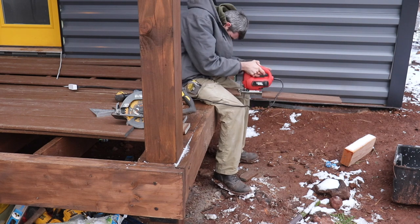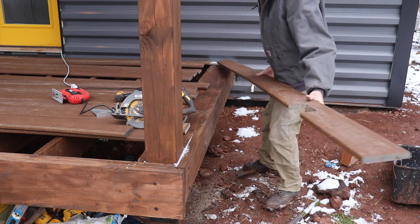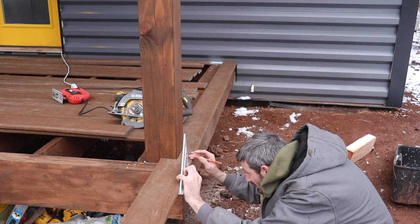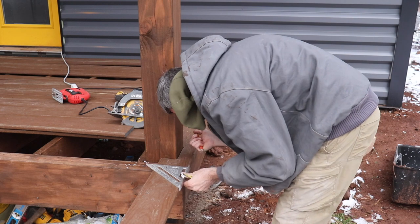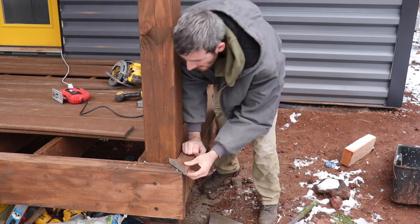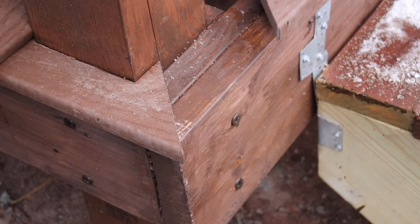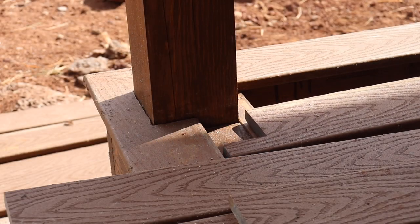And then you might be thinking to yourself, when we were building the structure for the deck, what was that horizontal, that flat 2x6 that we put in there for? We're doing what's called picture framing the deck. Because we're using these composite decking boards and the edges of the deck don't have the same color as the top that you'll see, the edges are the composite material, so it's like a gray. You don't want to just lay your decking boards all the way across because you'll see the end and it won't look great. You want to put basically a picture frame. So put these two pieces that go around and meet in a 45 around the deck, and that way you can't see the edge of all your horizontal boards.